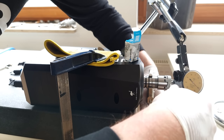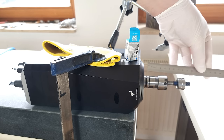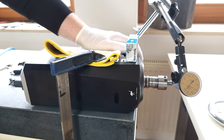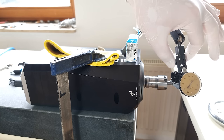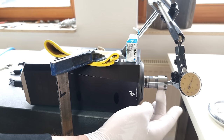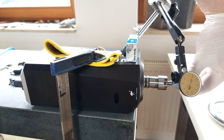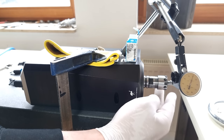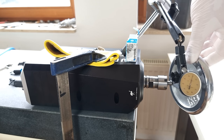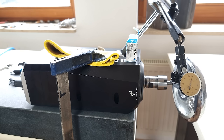Spindle runout given as a single micrometer number is kind of a hand-wavy specification — when looking at micrometers and below, everything becomes frighteningly flexible and temperature dependent. Spinogy don't seem to specify such a number on the website. Instead, you can get these configured with the highest quality GMN hybrid bearings and custom-made-in-Germany tool holders, essentially ensuring that within the category of small all-in-one spindles, your performance will be about as good as it gets. If you lean strongly against the tip of your tool 100 millimeters away from the front bearing, you can get plenty of deflection, some of which may stick around due to small shifts in the tool clamping mechanism. Generally I would say less than five micrometer radial runout easily, directly after the tool holder. To get something consistently better than that, you'd have to look at hydrostatic or air bearings.